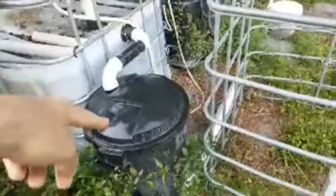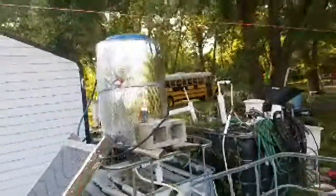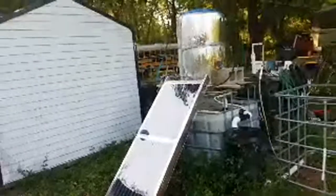But yeah, biodigester and solar hot water as one unit, and you don't need to build any infrastructure. The IBC tank is so useful for this. And then any overage we're getting is producing fertilizer in there. So you get hot water for your biodigester, and hot water for your shower, and hot water for your baby diaper washing machine. But do invest in 2 panels. One is great if you have 2 days of continuous sunshine, but if you don't, then you might be short a little bit of hot water.